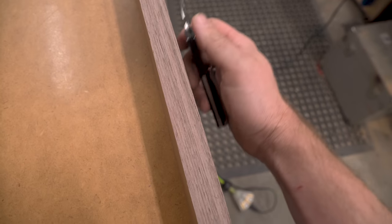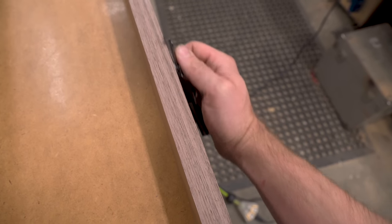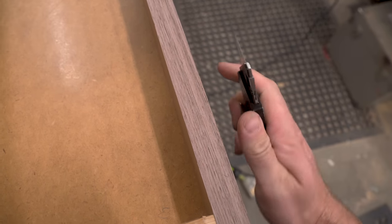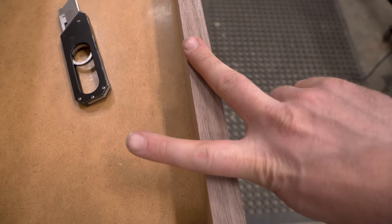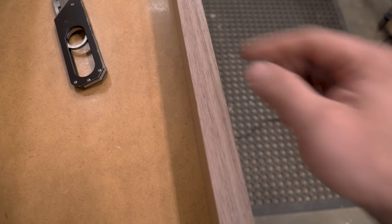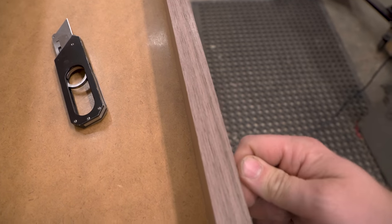All right, quick tip, if you are gonna be cutting this stuff, there is a better direction to cut it in. So in this case, I'm gonna wanna cut it this way and not this way, because you can see the grain cuts across here. If I were to cut this way, I'm gonna peel this grain out and it's just gonna kinda splinter off as I go down. And then on the opposite side, I'm basically gonna be cutting in the opposite direction because the grain is going this way and you don't wanna peel the grain out. So I'm gonna be cutting that way on this side, and there is a good chance that the grain will change directions as you go across the piece, so just keep paying attention to it. If it starts to peel out, reverse the blade and cut from the other side.